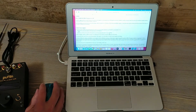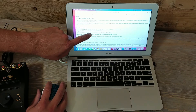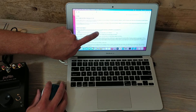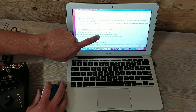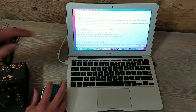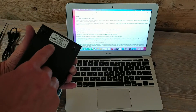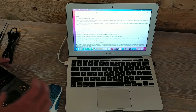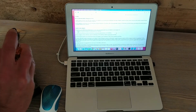Which version do we want? Download and unzip the latest Puffin firmware — check your serial number under the unit. If we have serial 1019 and older, we want the V130_old.bin. If we have 1020 or newer, we want the V130_new.bin. We have serial number 1035 — so this is after 1020, a newer unit with the newer clock oscillator. We'll go ahead and unplug this and unscrew it.